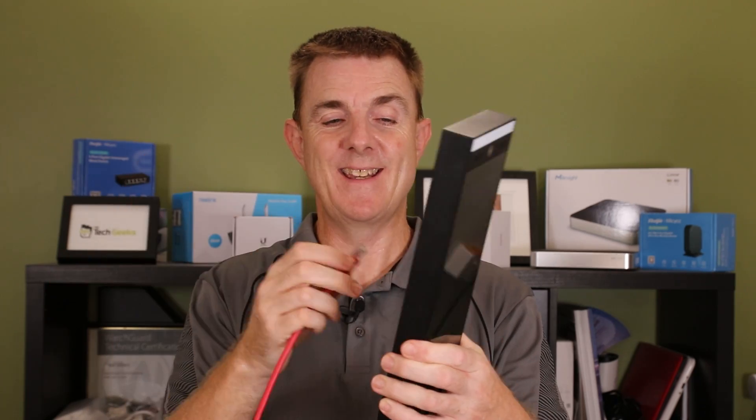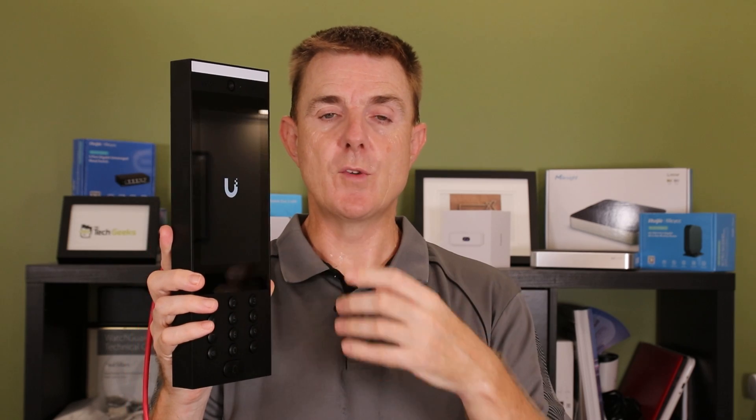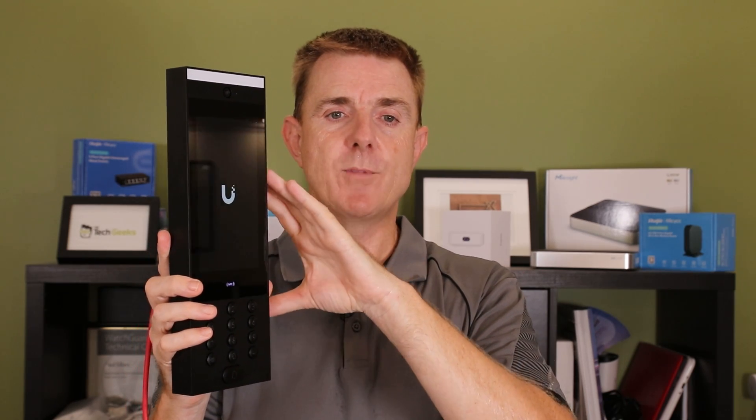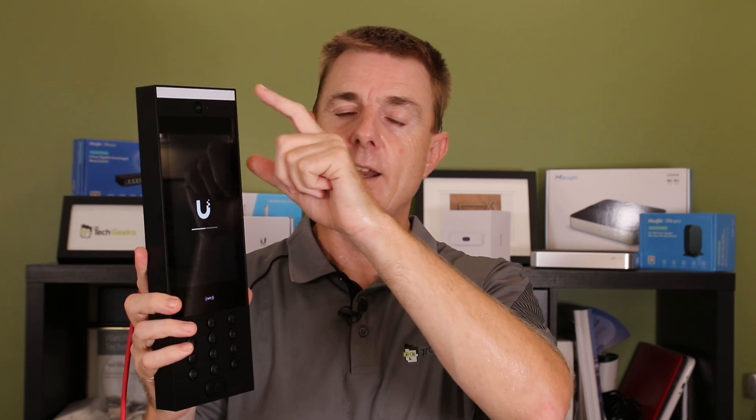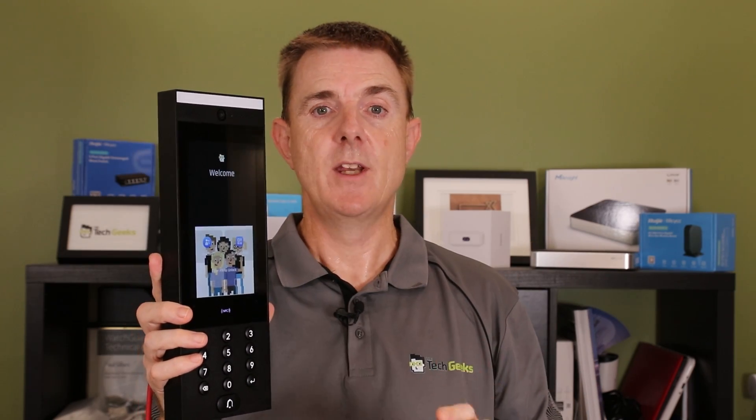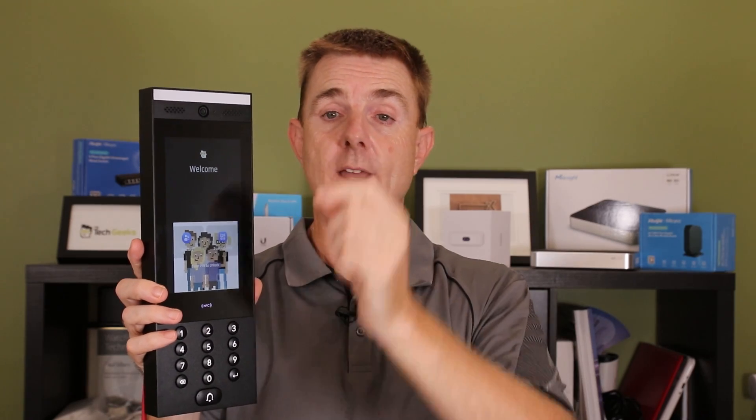Let me just plug this in so we can boot it up. As this starts up, let me talk you through some of the options. As I said, this needs to run with the UniFi hub. It is designed with the UniFi hub to be used to unlock doors. It has a camera, but at the moment it's not necessarily fully integrated with UniFi Protect — I'm recording this in April 2024, so some of the things I talk about are significant to that. This will capture screen grabs when somebody pushes the button. But you do have options in the setup to tie in any UniFi Protect cameras you may have, so when the button is pushed those cameras will start recording as well — quite a neat feature.